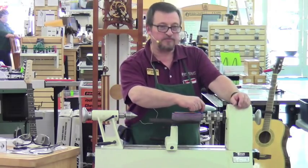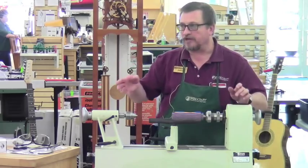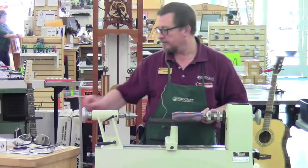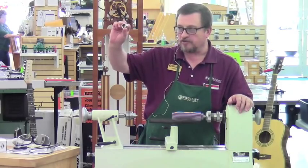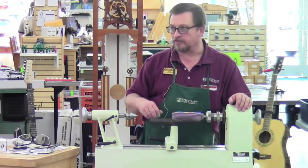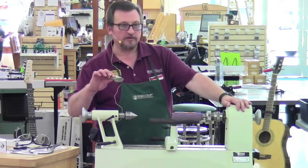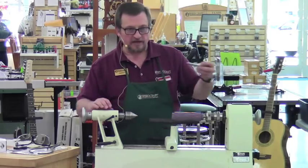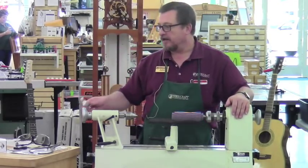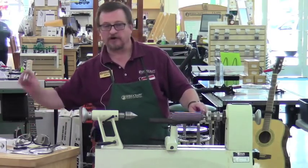The question was, could you put a threaded brass insert into the handle first? It's actually an idea I'm toying with right now. What I haven't yet figured out is if you can turn the tenon that the ferrule goes onto to the diameter you need and still drill a hole large enough to hold a three-eighths by 16 threaded insert. For purposes of washing, a threaded insert would make it easier and more stable to put the scoop in and take it out. Yes, I think it would do exactly that.